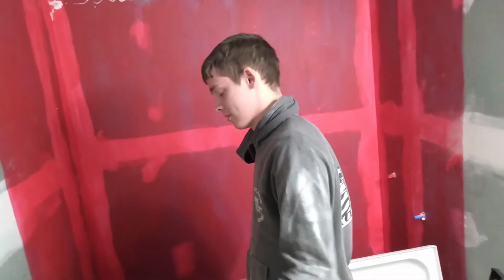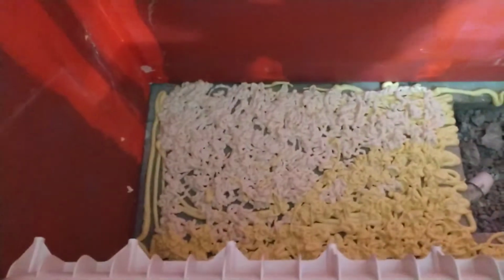Checklist when it comes to leveling, measuring, all that. Measure twice, cut once, level twice, set once, because we had to do this, take it up. The floor wasn't level. So we needed to basically throw some foam down so it's self-leveling, basically. Guys, I just realized I said something really stupid. It's not self-leveling. It just basically supports it from where we leveled it. We stuck some screws back in and then basically leveled it. And that foam's gonna help it not to fall down. So I don't know why I said that.